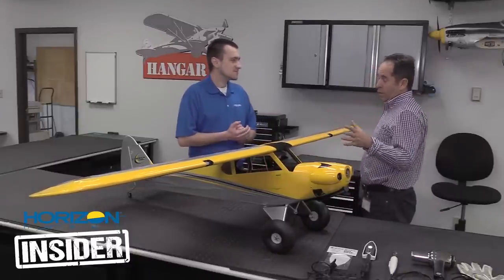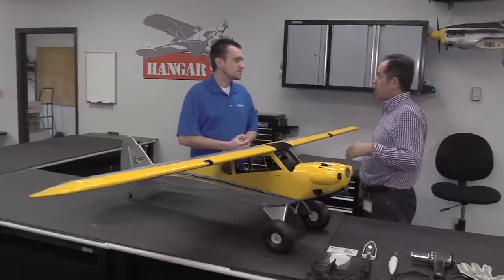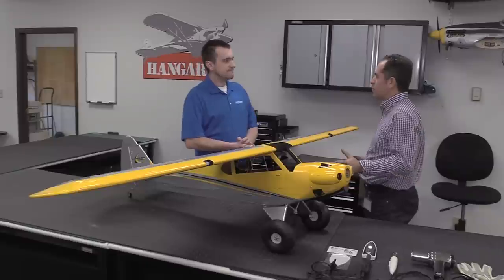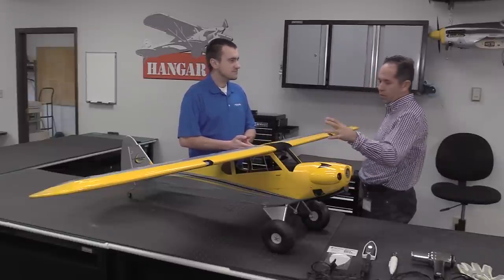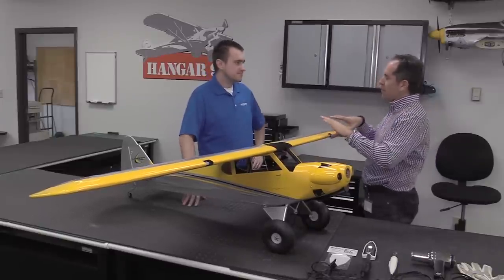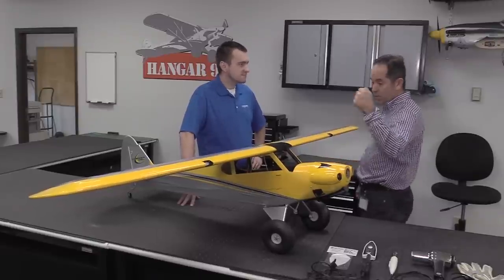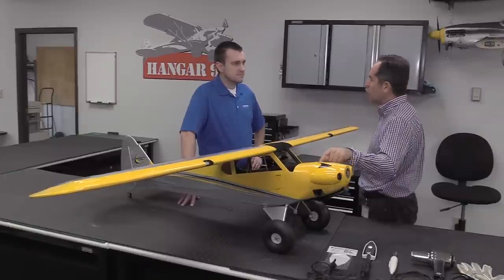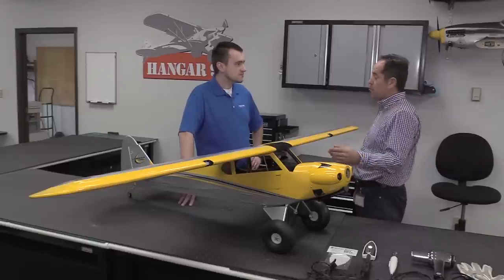This ironing isn't a one-stop deal — you may have to do this a number of times whilst the humidity stabilizes. When you go out flying in the middle of summer with humidity at like 90% and then bring it back to an air-conditioned workshop, the glazing areas need extra care. Certainly for this initial shrink it's better to have all the fragile bits off. You could even have the cowling off, because the hot air gun gets hot and could damage the fiberglass.